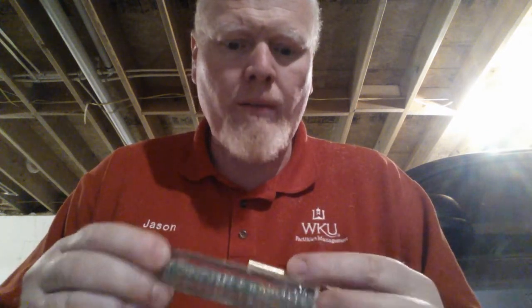Now that I've got one end squared up, I'm going to take the original brass tube that comes with the kit and measure the length I need out of this blank. If you do not do this part accurately, the pen is not going to function right — too short or too long, your pen just won't work. I want to make sure I take my time and get the length very accurate. Once we have it trimmed and squared up on the other end as well, we'll chuck it up in the lathe and begin turning.